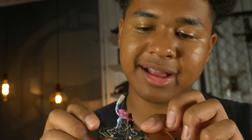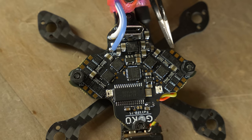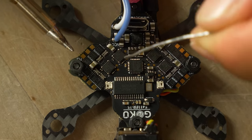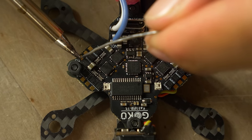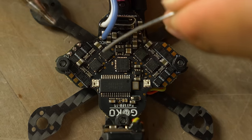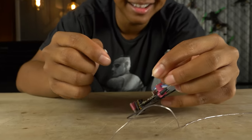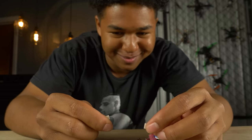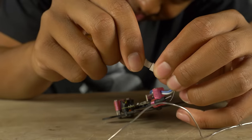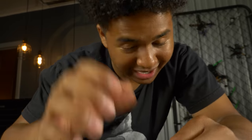Now tin all twelve motor pads. Place the soldering tip down on each pad and apply solder — boom, boom, boom, done. After tinning all the motor pads, go ahead and plug in the battery briefly to check nothing is wrong. I'm not using a smoke stopper — you really should use one — but I'll know if something's wrong if smoke appears. We got lights, so we're good.